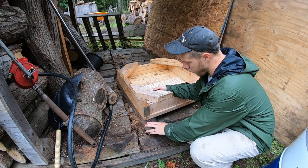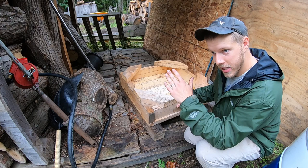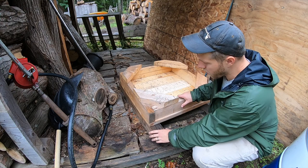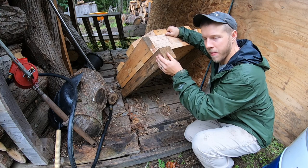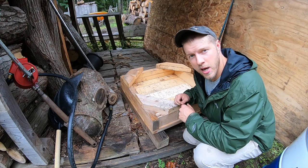One thing I want to address that I didn't mention in the last video — there's a square edge on this 4x4 base. The problem was when I tried to drag this out of the bed of the truck, it caught the lip and tilted up. I don't want to spill 55 gallons of fuel anywhere. If we put a 45-degree miter on the corners, it'll relieve that angle when we drag it out and clear the tailgate. Let's bring this to the shed and make some adjustments.